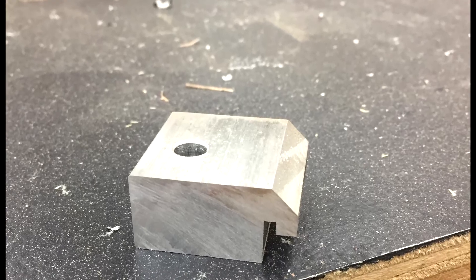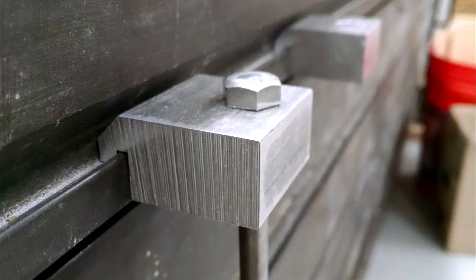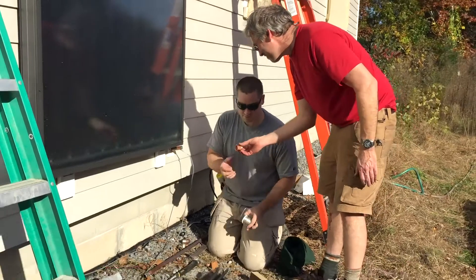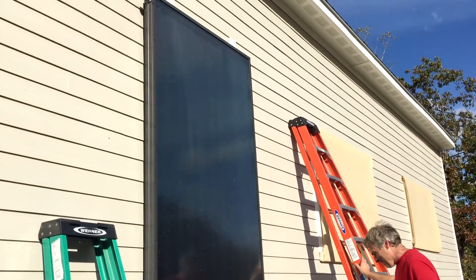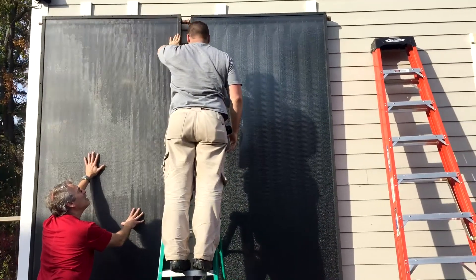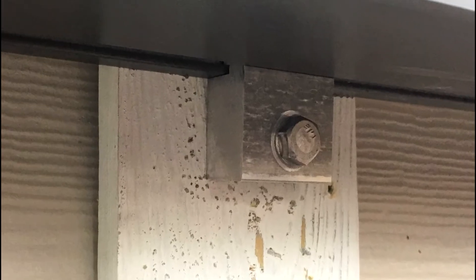Each aluminum clip is one-and-a-half by one-and-a-half by three-quarter inches thick, and you can see how nicely it locks into the groove on the edge of the solar collector frame. Bill has given me a hand with these solar collectors. We are soldering unions onto the stub outs from the solar collectors, and those unions are what we're going to use to join the manifolds together. There are four clips per panel, secured with five-inch long stainless steel lag screws.